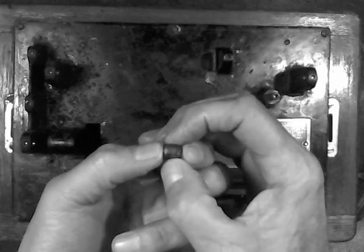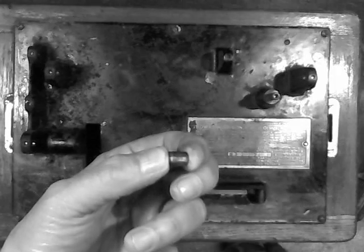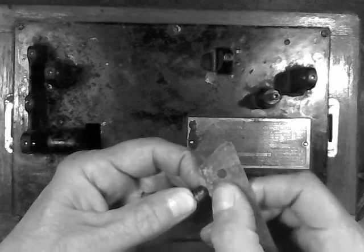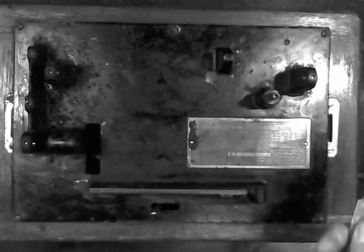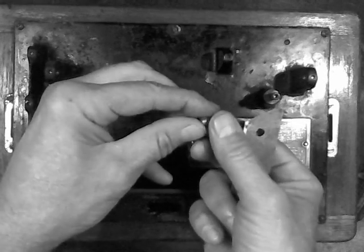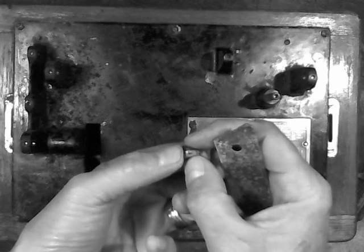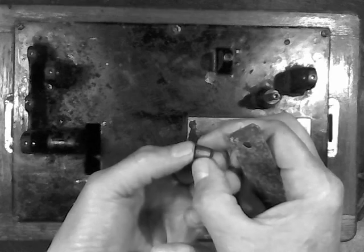You can see the discoloration on this bearing. Rather than trying to clean it with an abrasive like garnet paper, just take an old razor knife and scrape it in straight lines. You can see this junk coming off and the metal is getting bright silver again. Once you've scraped all that corrosion off, the bearing can be pushed straight through the hole. It really makes a tremendous difference in its size. This oxide actually increases its diameter by a thousandth of an inch or so, making it almost impossible to move.